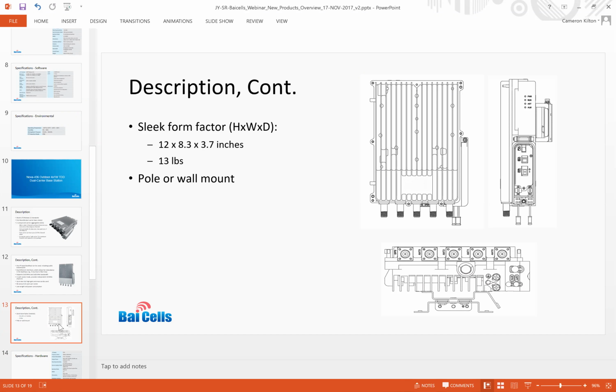So our competition in this space usually is well over 100 watts. And that's something to take into consideration when selecting product, is how much is this going to work your battery plants. I'm a big fan of negative 48 volt rectifier systems, and obviously you get a little bit more runtime the more efficient you can get. And if you're anything like my area, where it's very rural, power can be a problem, and as most ISPs, we're familiar that power isn't always stable, so the more runtime the better.